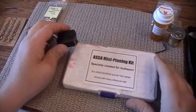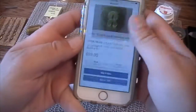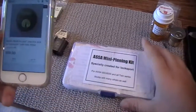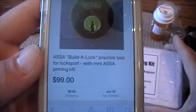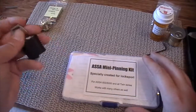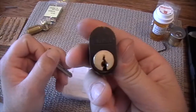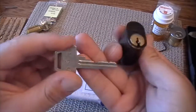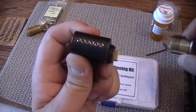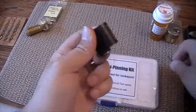The next one is from a seller I think named jdu1957 off eBay. This one is called the ASSA Build-a-Lock practice lock from a guy out of Draper, Virginia. It's an ASSA core with a 600 keyway plug, comes with a key with pretty good bitting on it — a standard ASSA key. He drilled the tops the same way as they do with the Ultimate Challenge Lock so you can take an allen wrench and unscrew all the pins and pin it up however you want.